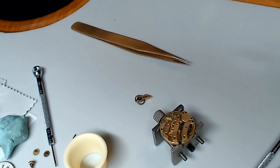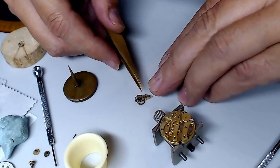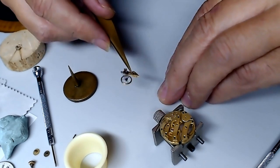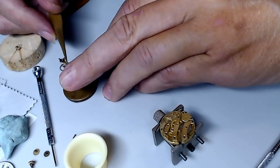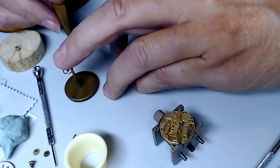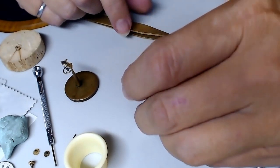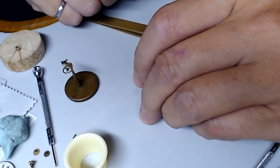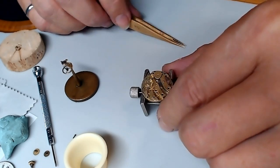I've got to grab my balance tack and put that on really carefully — I didn't have it on the workbench, which is a bit stupid. I may just rest this down so I don't inadvertently screw that up. I'm doing like miniature work here. It's on the tack — so small it doesn't even want to stay on the tack. I'm really cautious about fouling the hairspring on this, because finding another hairspring for this watch would be probably impossible.